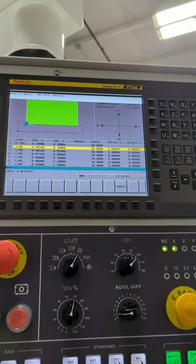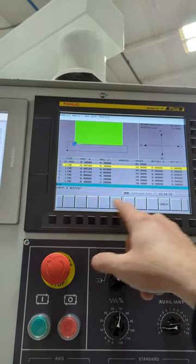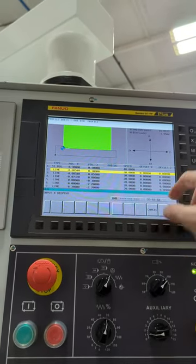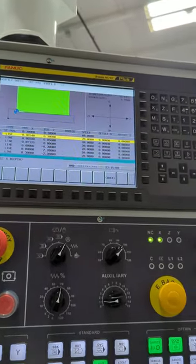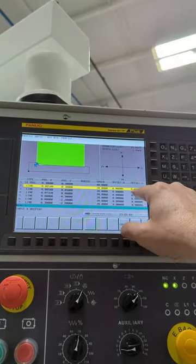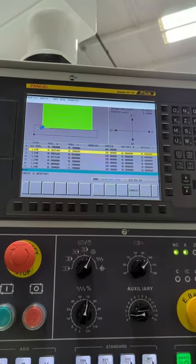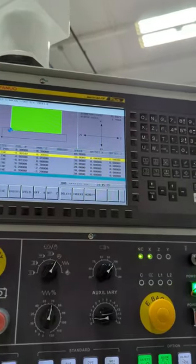And then you put something in. I'm going to hit cancel this time, but you put something in, you go right across here. Really, it just wants X and Z. And then say something was a little bit wrong, you have some control here. You can offset it. If this wasn't straight, which happens to be the case here, it worked out well. But if you got some kind of taper, you could correct any alignment here if you wanted to. Alignment or just the location or where your features ended up. Anyway, I'm going to say cancel. So that's the profile set up.